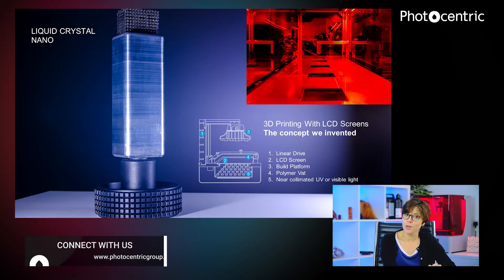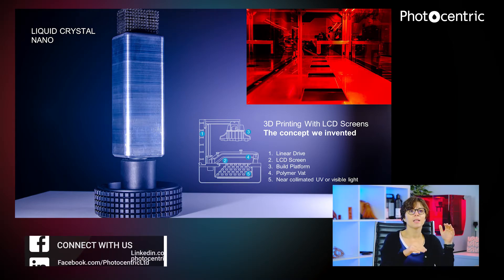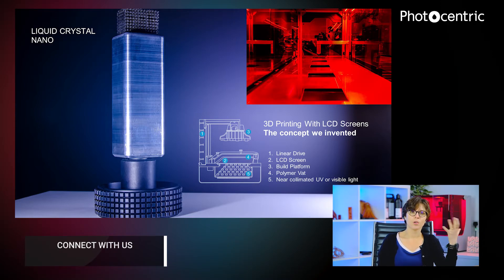We have designed a 3D printer for this process which doesn't only include a 3D printing station — as you can see in the upper picture — but the platform then moves along the x-axis into a washing station, a second washing station, and several post-processing stations. And this is to avoid handling very delicate electrodes and avoid cross-contamination.